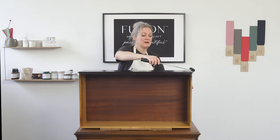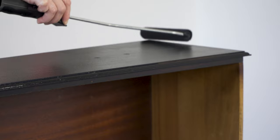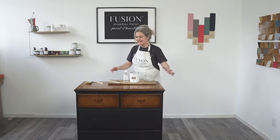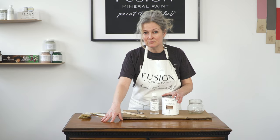I may very well get away with just doing the one coat. I'm going to go ahead and paint the rest — the other drawers, the sides of the unit, and the top dentil molding — and then start on my gel stain top coat. I used one third of a pint of the coal black and painted both the sides and the two front drawers. It is a flawless finish. I used the Stalmeister rollers and I'm super happy with the end result. Now it's time to apply the gel stain and top coat onto this top, which has a damaged lacquer finish.